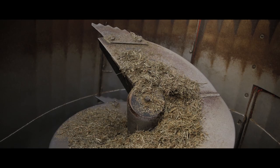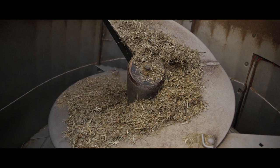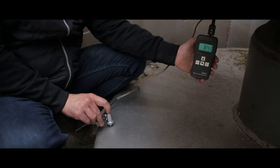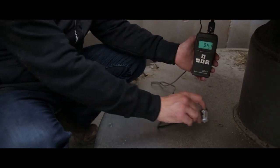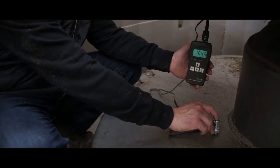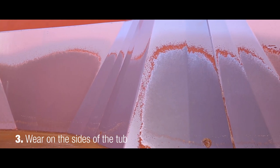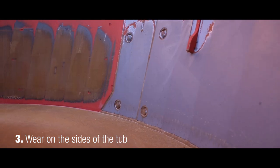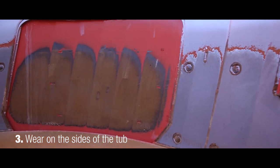This auger is made from standard steel used universally in mixers on the market. It has worked for more than 10 years. The auger's original thickness of 15mm has decreased to 8.4mm at the edge, but it is also down to 10.4mm at the center of the flighting. The sides of the mixers will also be subject to wearing — the strands are chopped mainly in the bottom 60cm, and the thickness of the sides can be easily inspected at the discharge doors.